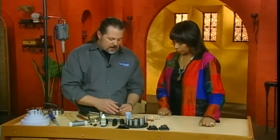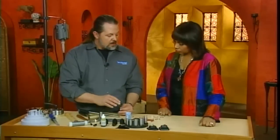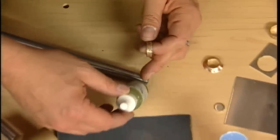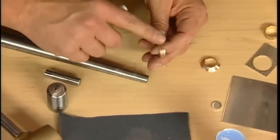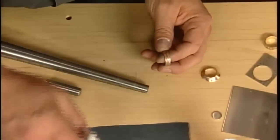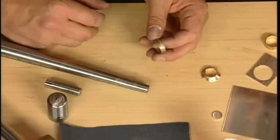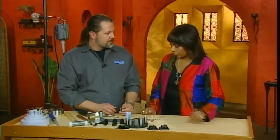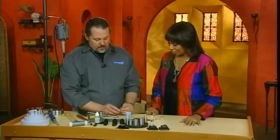Beautiful. Now what's going to happen is if you sand that, you'll lose a lot of that color contrast. It'll all look kind of washed out. So what you can do is use a patina. There are some patinas out there that will just oxidize the copper and not the silver. So you'll darken the copper and still have that silver look to it. So you can still have that kind of two-tone Mokume Gane look. But without the rough parts, because you smoothed it out, which is terrific.